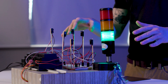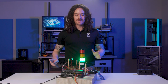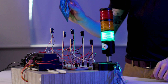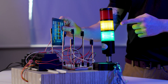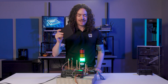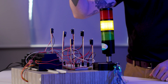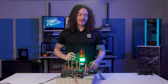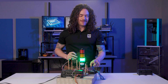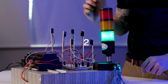Now we have the Opta with the sketch loaded and everything connected and powered on. Let's see how it works. When none of the sensors are covered, the green light is on. When I obstruct the first pair of sensors, the yellow light turns on, and obstructing the other sensors does nothing. When I obstruct either the second or third pair of sensors, the yellow light comes on and the green light turns off. Now when I obstruct both the second and third pairs of sensors, the tower light turns red, the DC motor turns on, and the very loud siren inside the box turns on.